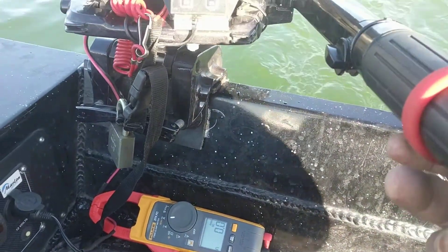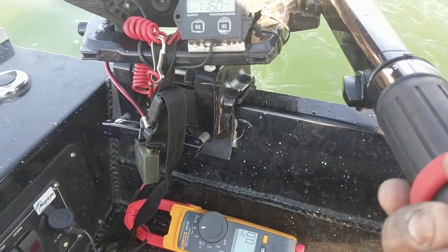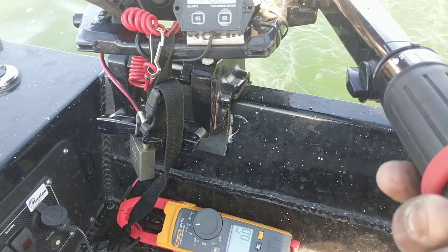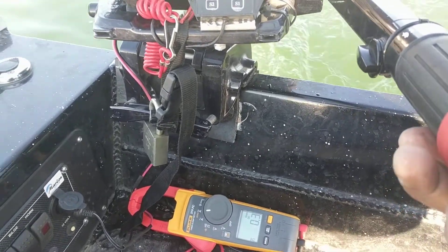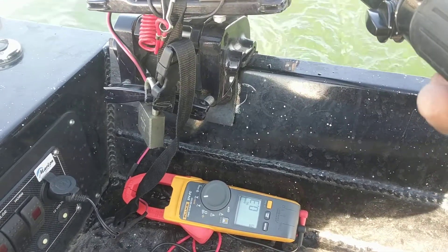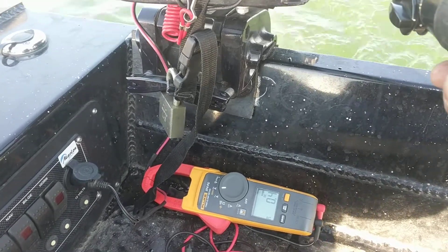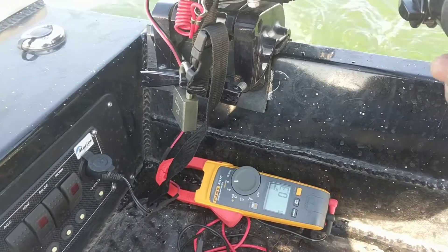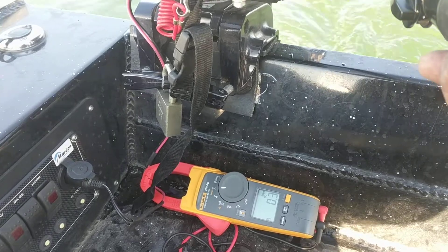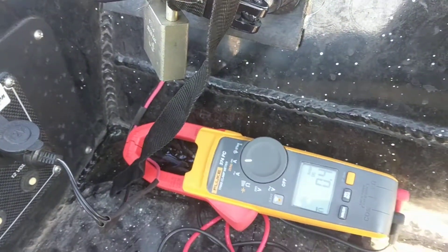Let's give you some numbers — mine's in the sun here. If you don't hear me I'll just keep panning between the meter and the RPM so you can see exactly how many RPMs it takes to put out. I can't get above 4200, that's just where I max out on my prop. So at 2000 RPM, it's putting out half an amp.